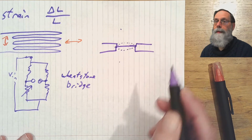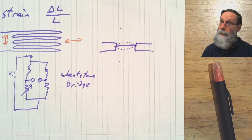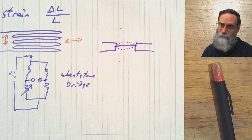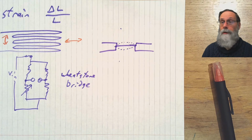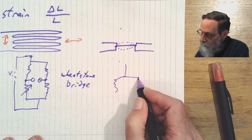downward. And what you can do is you can put a strain gauge on the surface of that membrane, and it gets stretched a little bit as you bend it. The lower side may even get compressed a little bit depending on exactly where on the membrane you're putting it. So by which surface of the membrane you're on, you can measure the stretching or shrinking of the membrane with a strain gauge. And the pressure sensors we use have something very much like the Wheatstone bridge inside.